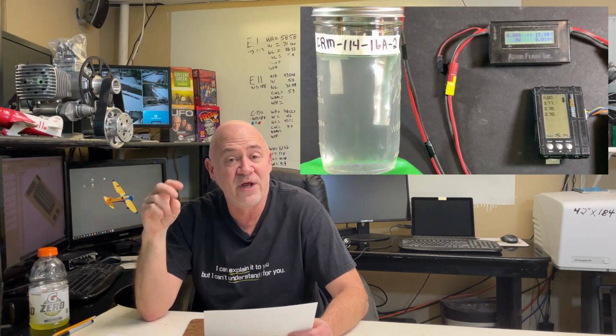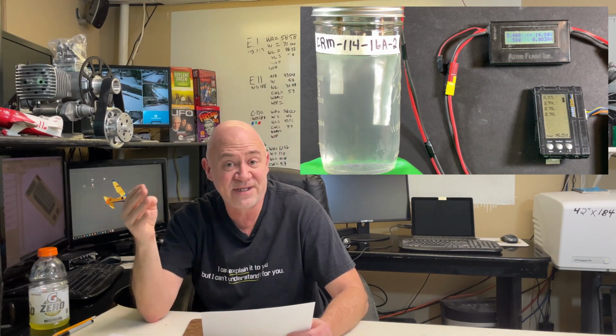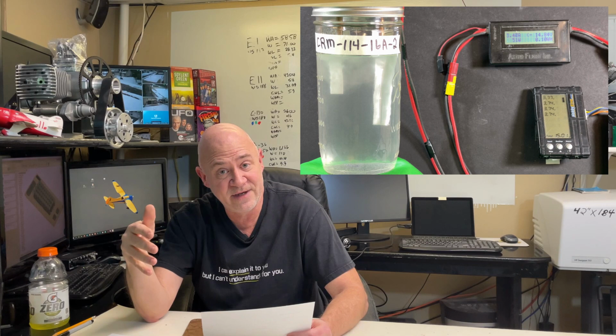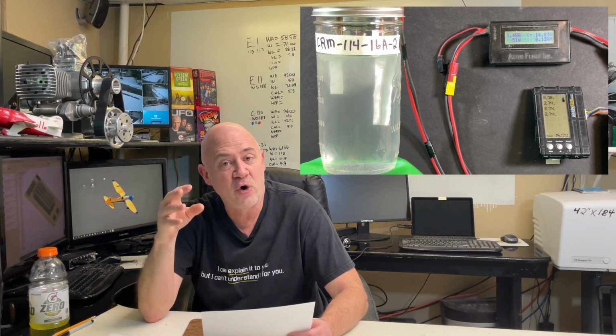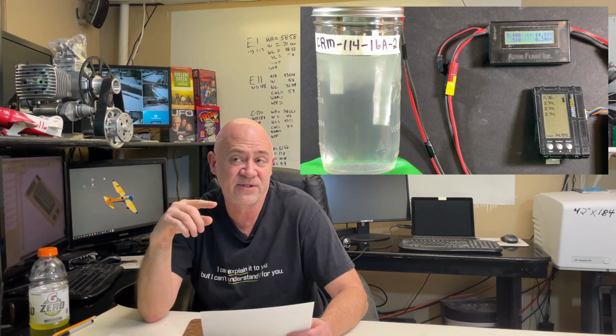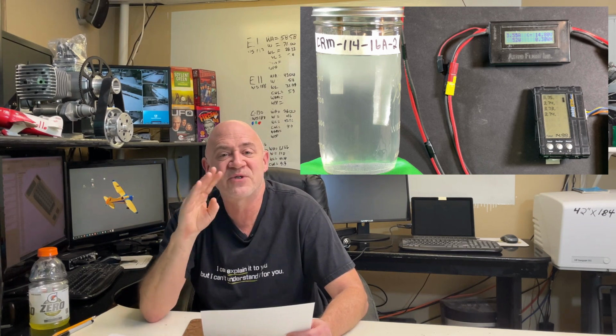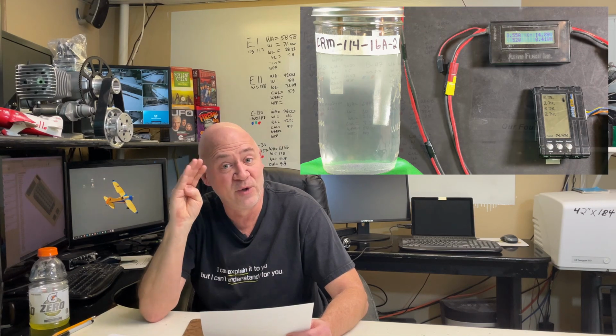So your positive is an anode and your negative is a cathode if you're doing electrolysis, where you're sticking 2 probes into water, and with the different salinity levels, you're going to get different conductivity levels. But also, the stronger the electrolysis is going on, the faster it will attack aluminum. It doesn't touch the nickel and it doesn't touch the tin and silver coating over the copper. And if you have bare copper, it doesn't attack the copper. It will slowly attack the copper, but the aluminum will go on the positive side much, much faster.